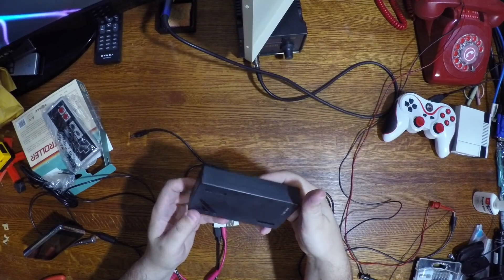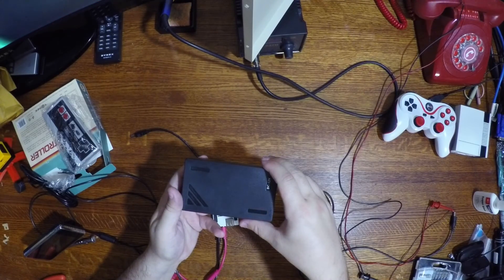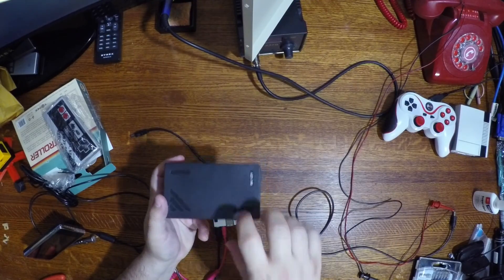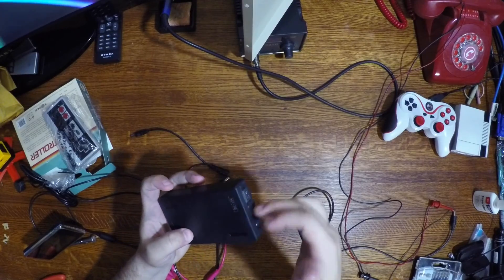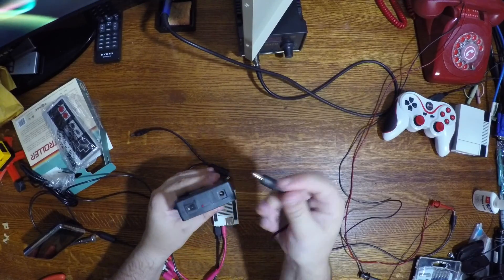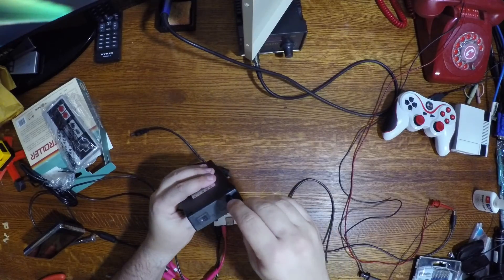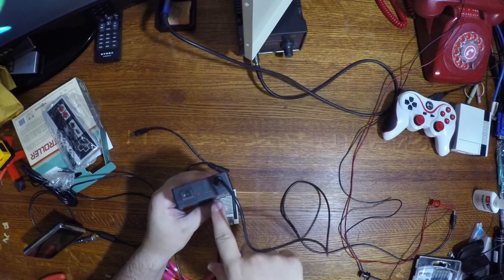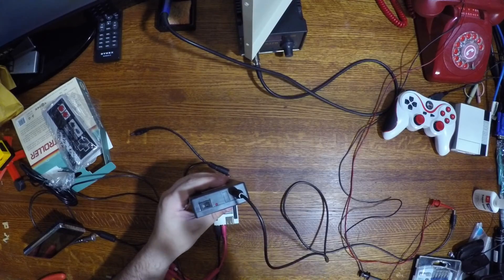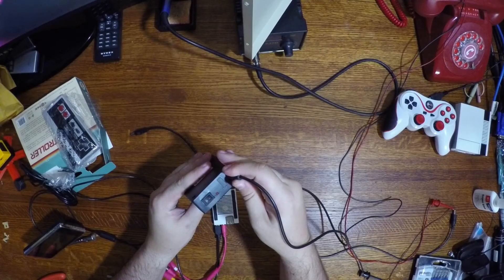Second, the crazy thing is I thought this would be like a 3.7 volt lithium with a boost converter or buck converter in the case because it's kind of big. It's not. It's three 3.7 volt cells stacked and wired together directly to the output. The scary thing about that is this is just straight up 12 volts dumped right into the battery packs. I think there's protection circuitry on them, but I'm not 100% sure. It hasn't exploded yet, but we're not going to leave that plugged in unattended.